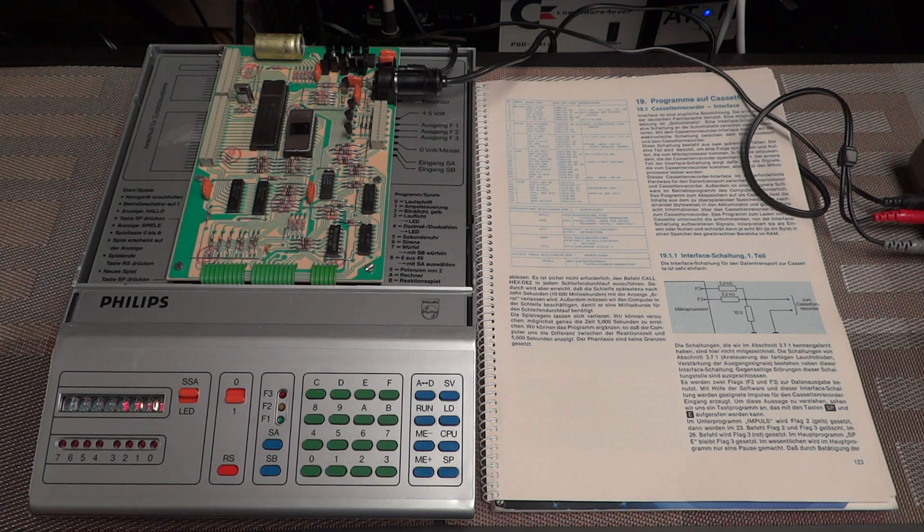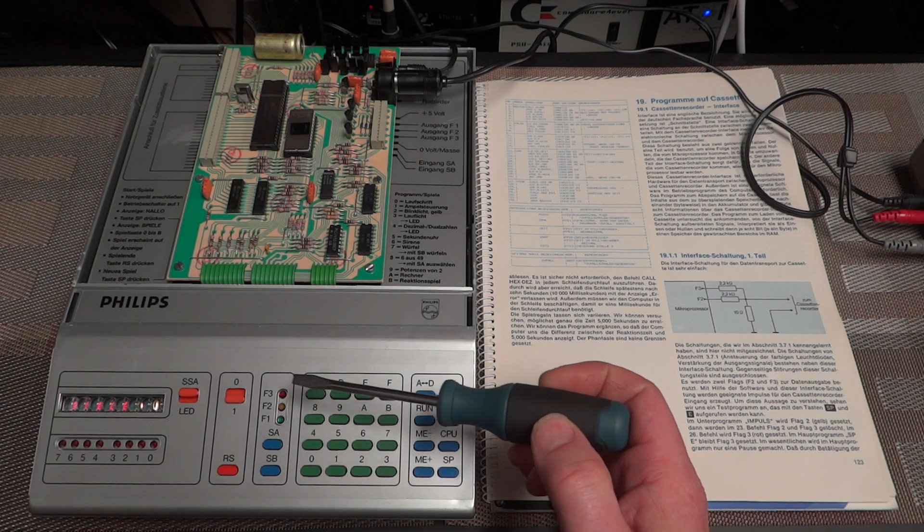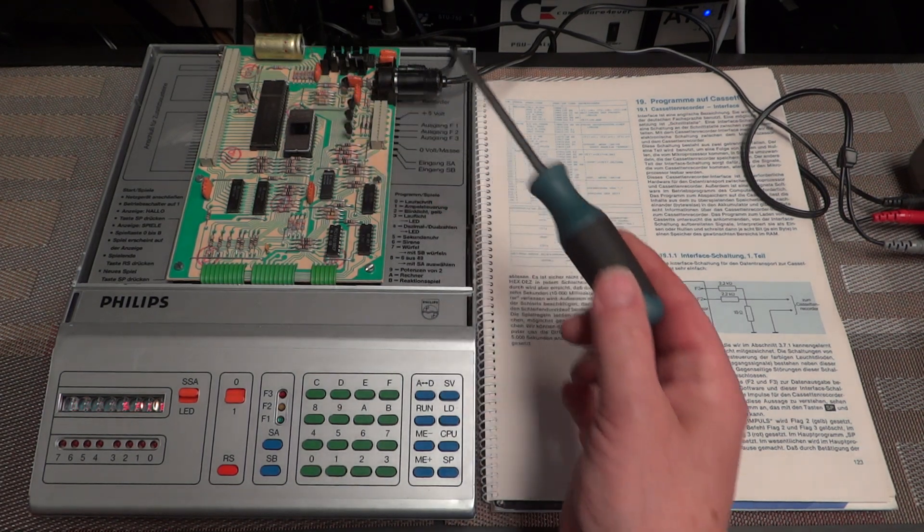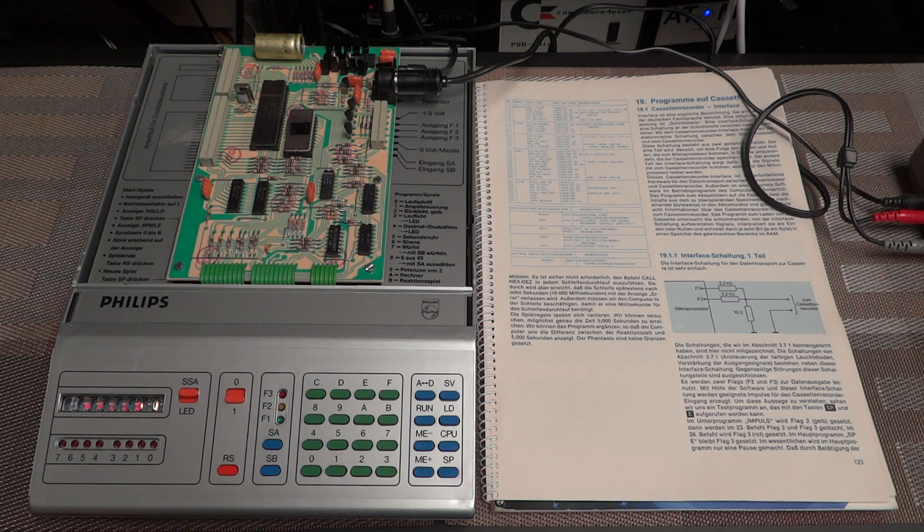Let's look at why this interface is ingenious but also very tedious and delicate. The SC/MP-3 has a register used to control three digital outputs and two digital inputs — the so-called flag register. GPIO is implemented directly over the CPU. In the flag register we have three output flags: F3, F2, F1, which you can set with machine language instructions. We also have two inputs, SA and SB, also in the flag register bits, which you can read out with machine-level instructions. The status of these inputs can be observed live in the flag register in the CPU.